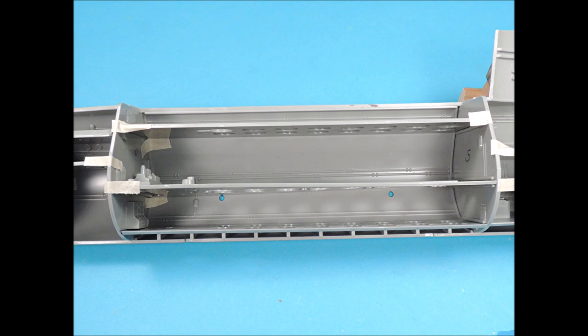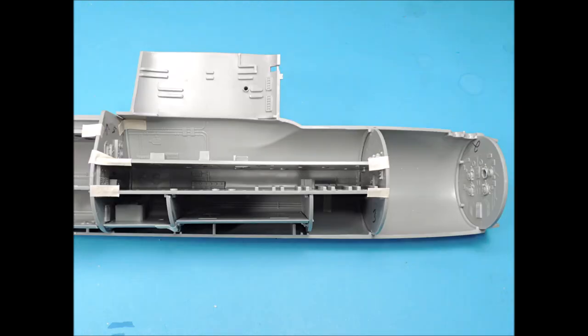However, the upper deck section had a slight bow in it, and the center deck section had a slight twist. Both of these are going to need to be corrected. The forward vertical bulkheads, as well as the multiple decks in this area, also cleaned up quickly, and they fit very well in their respective locations, and there were no twists either in the bulkheads or the decks.